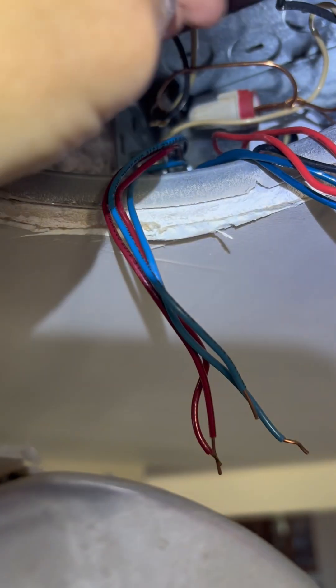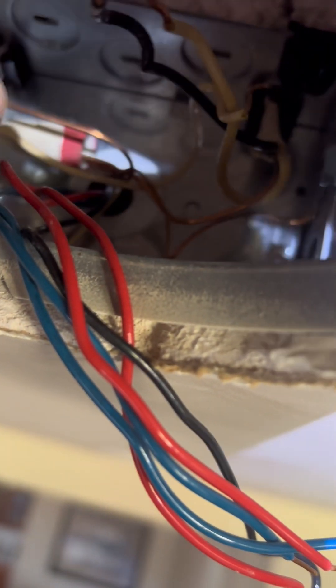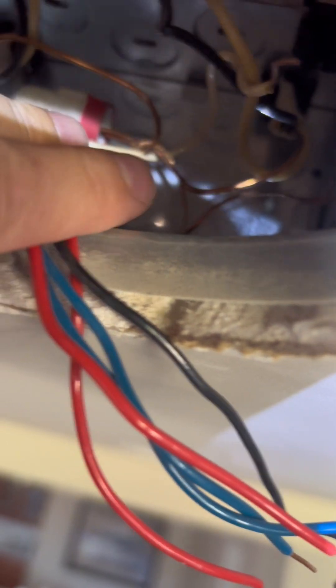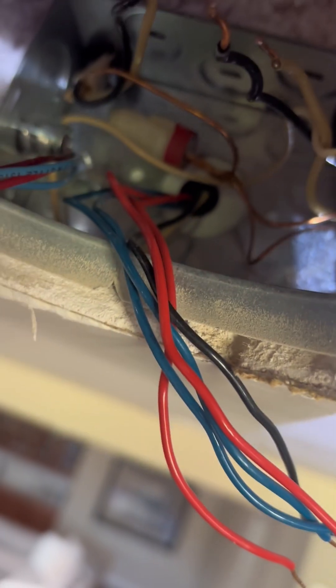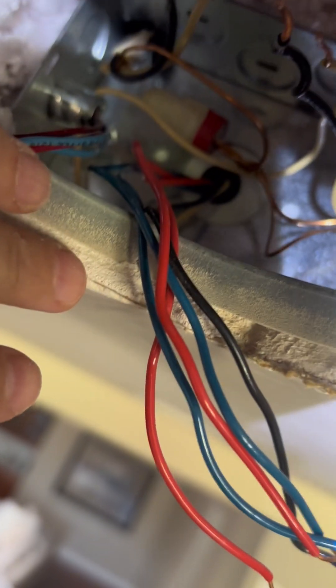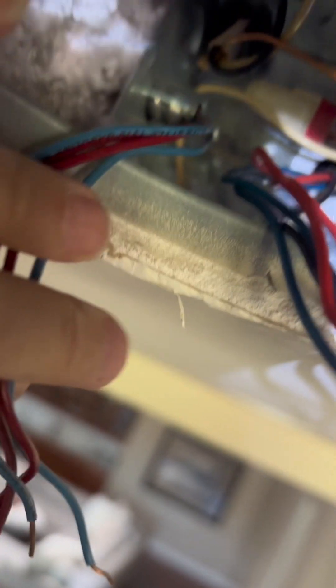So I've undid the wire nuts. You can see there's a casing around the black and white wires on both sides — that's the electricity line connecting all the lights together, which is why there are two sets. If it was the end of the line there would only be one. Now you have the other wires here that I took the wire nuts off of. The wires coming out of the middle of the box are trash — they're going bye-bye.